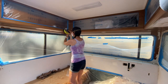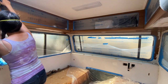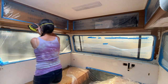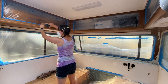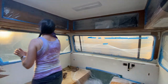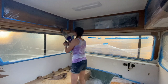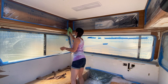The next step is to give the surfaces a light sanding. You want to rough up the surface enough for the paint to stick, so this is a pretty important step, but it created a lot of dust so I decided to put my mask on. The sanding created a lot of dust so it's really important to clean it off as much as possible — I ran the vacuum cleaner over all of the surfaces and then also went over it with a damp cloth to wipe up any excess dust.